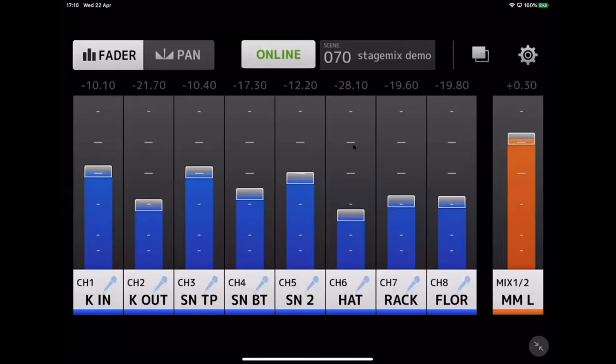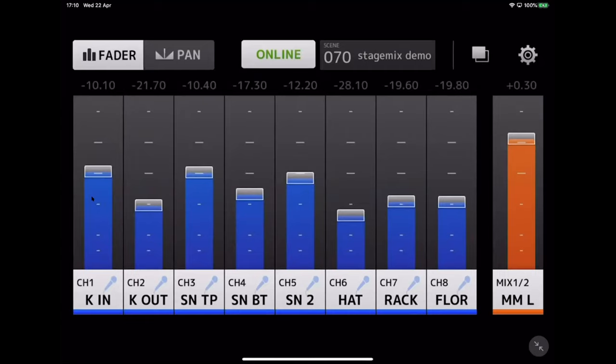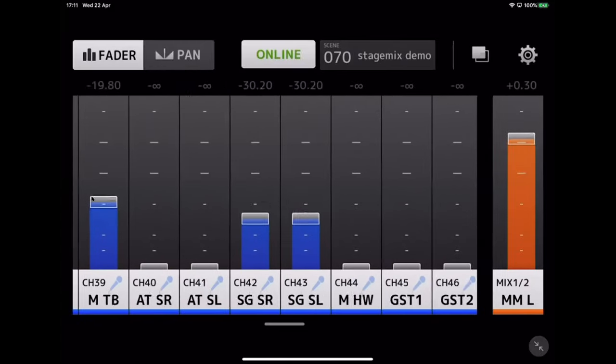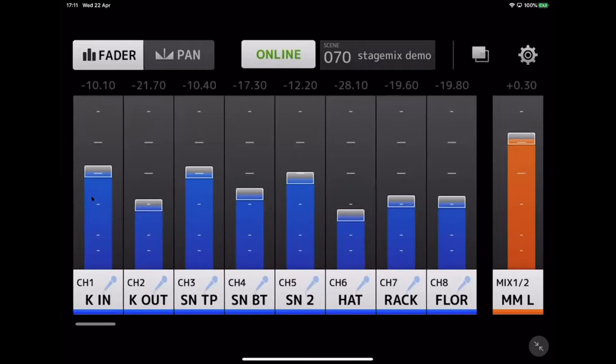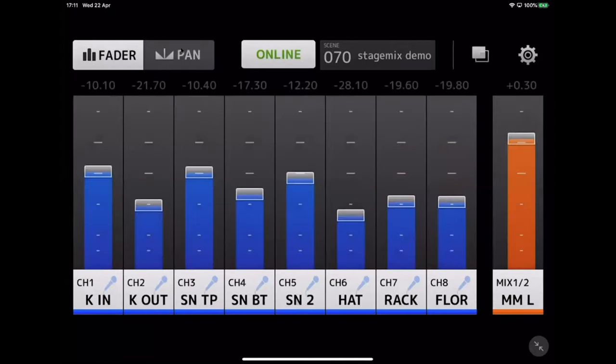Here's a brief layout of how Monitor Mix works. On the right-hand side, I have a master level control — in this case the master faders for Mixes 1 and 2, which is your output master level. In the middle, scrollable left to right, we have all the mix-send levels for Mixes 1 and 2 for all channels of the console. Using a CL3 today, that's a total of 64 plus 8 stereo channels. You can also control the pan from the top left corner. If it's a mono mix, the pan option would not be available.